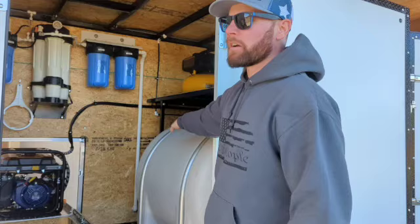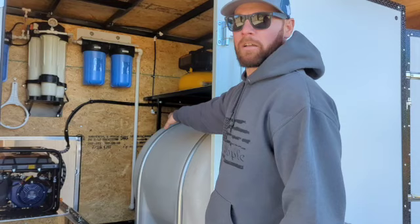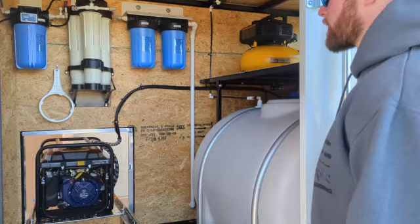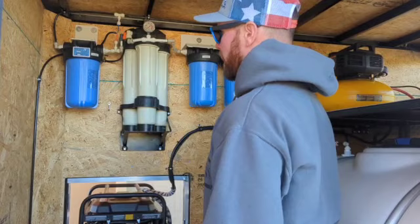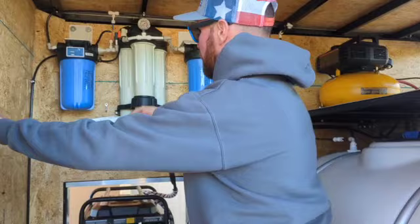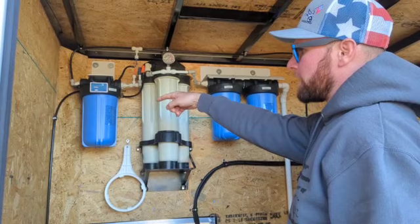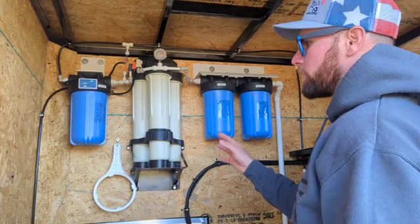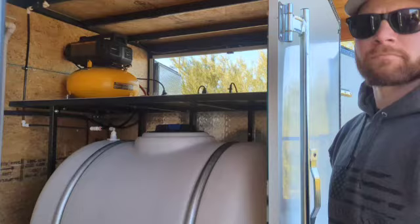After that, it comes out and goes into the water tank. That's an auto shut-off valve — so when the tank fills up, it pushes the float up and the water flow stops, so you don't have to remember to turn off your water; it'll do that automatically. Over here on this wall I have the filter wrench, which is made for your four-and-a-half by ten inch Big Blue filter, so when you need to change them, this tool makes it easy. These filters you're probably going to change every six to twelve months. The RO filter is one to two years. The DI resin depends on your water quality. It's highly recommended that you use soft water from your house — that's going to give you longer life on your DI resin, as well as longer life on all the filters and better product water.